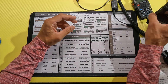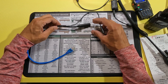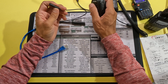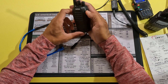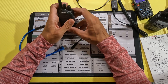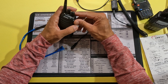Then I thought, well, we could do that. I just finished a boom mic cable from the last hack, with a little microphone input and a PTT switch. I said, what if I just plug an old Baofeng speaker output into my mic input and use that? That ought to work. I was telling my friend about that, and he goes, that's like a crossband repeater. Oh, I didn't know that. I made it anyway, because the 991 doesn't have crossband repeating, and I wasn't going to buy a radio just to crossband repeat to sit out on the patio and check into the local net.